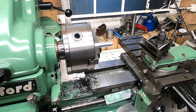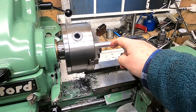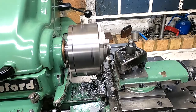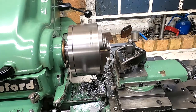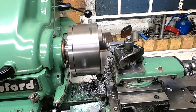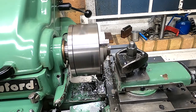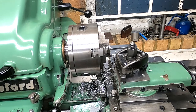I shall simply take a hacksaw to that. Then eventually I'll reverse all these little bits, face off the hacksaw cut, and pop a hole in them. That'll do nicely. This is the last of these little top hats. I've set the slide and locked the saddle so this is going to move across. In fact all of these dimensions are going to be the same thickness, so that gives a little bit of consistency — a hint of mass production — where they all end up roughly speaking the same, or close enough. So the next thing now is to run in with the center drill.